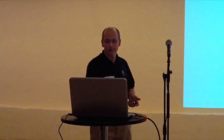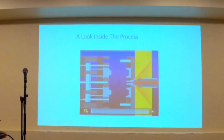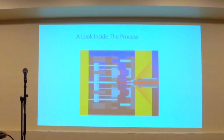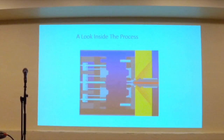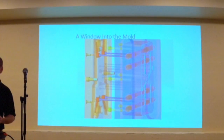For those of you who are new to the injection molding process, we've got a mold and plastic here and a mold cavity with two halves. We're going to watch the plastic squirt into the mold cavity, it freezes, and then these pins pop the part out. Right behind the pin is where we put a sensor. Here's another representation of the mold cavity where the part is made — pushing on the ejector pin — and this is a half-inch button style load cell that measures the pressure of the cavity.